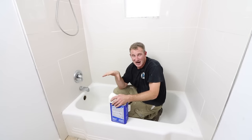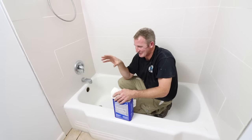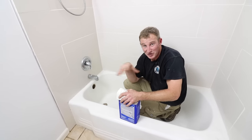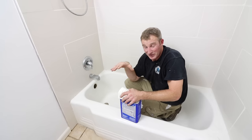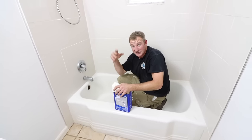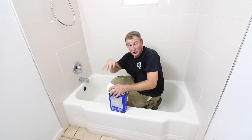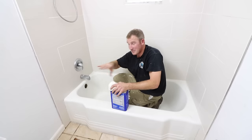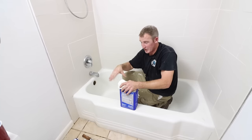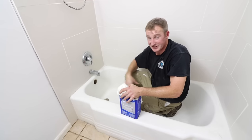You always have to make sure the temperature in your bathroom is between 70 and 75 degrees. If you're in a vacant home that's turned down a lot, get a space heater in there — the temperature affects how you finish the tub. Second tip: do the cleaning the night before or the day before. It makes taping a lot easier, and any water on the tub is going to create a problem. I like to do all the prep the night before and start the actual finishing the next day.